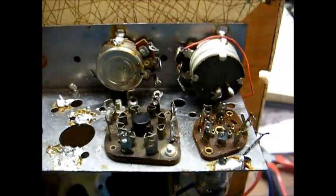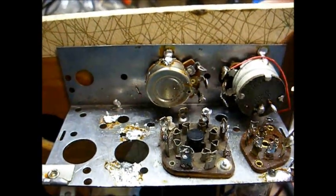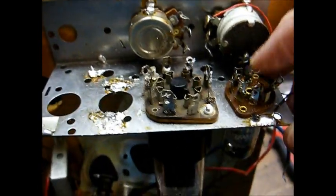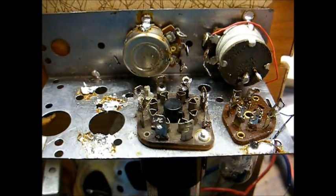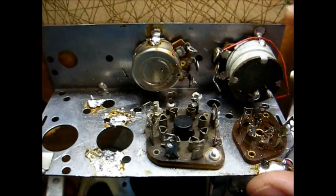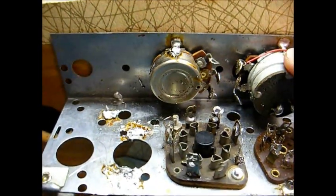Concerning our wiring of the circuits, you want to keep all component leads as short and as neat as possible. That will minimize any type of hum pickup and will make your work look more professional. You might have to switch the positions of tube stages — originally this socket contained our output tube and that was the only tube in the set. I chose to install our 7-pin driver tube in this socket and add our 25L6 to the newly added socket, because this is our volume control and our coupling capacitor will be coming off of this control to this tube socket. So it'll be easier to do it that way.